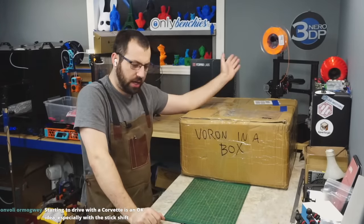They search for the kit and they buy the cheapest kit because people are cheap. We can't help that. People are cheap, okay? They go buy the cheapest kit from CN4445828, number one store off AliExpress. It's got two orders, okay? But it's the cheapest one, so they buy it. And they go home and they download the manual. And they start building and they make some guesses because, I swapped out the extruder on my Ender, I can do this. And the SSR is wired backwards.